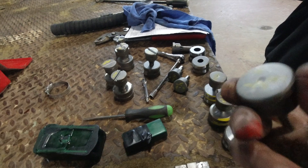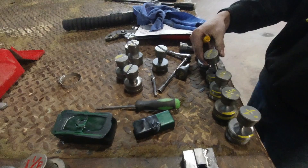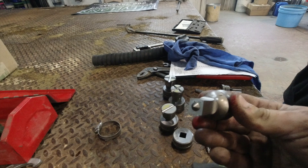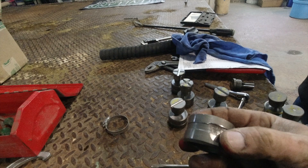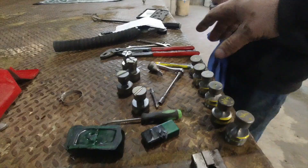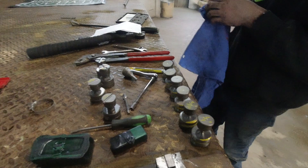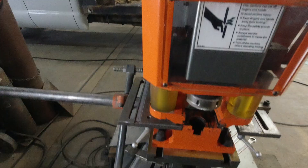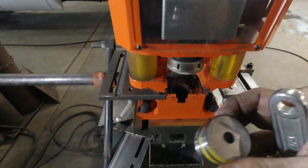I didn't know any better and ordered them oversized. Now these new ones — like this is a quarter inch bolt — it's a nine thirty-seconds top die, so I'll be able to not have to do any reaming; everything should have a little more space. We also got these squares that have a keyway in them — this is the top die, bottom die. The bottom die has a spot for a set screw. I'm going to put the three-eighths die in for the bottom; it's actually bigger than three-eighths but that's beside the point.